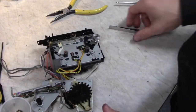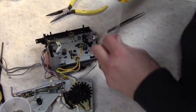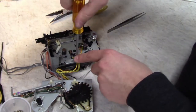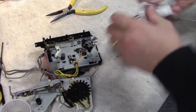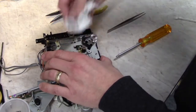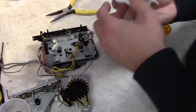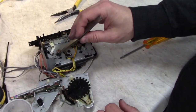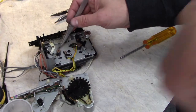Okay, so let's put the screws back into the plate here. Fifth one goes through that little loop that holds the wires in place. These help hold the wires away from the flywheels. Okay, I'm going to clean the molly lube off. Capstans here. A little alcohol. Yeah, these little springs are little ground straps to ground the capstans because they're insulated otherwise.